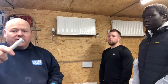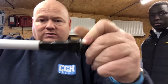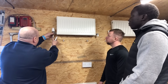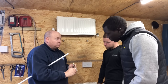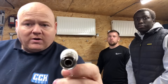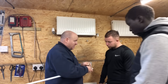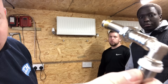To clean the end, when we look at the end of the pipe, we need to put the cleaning tool in the end — what that does is it just deburs it, and when it deburs it, it gives you a little bit of plastic on there. Then if we get the fitting and have a look at it, it's got some holes. What we need to do is push this pipe in and we can see those holes, and we know that we've got it fully in. So then — this is brass inside here, so it's a really good quality fitting — we push that on, see how easy that's gone on? And it's in.